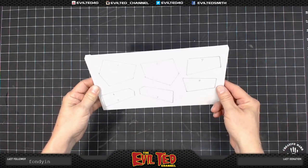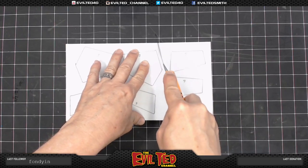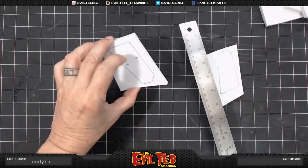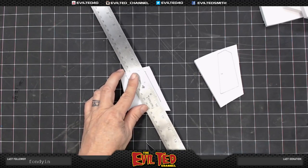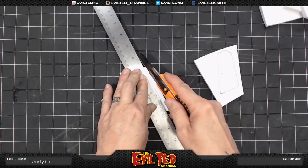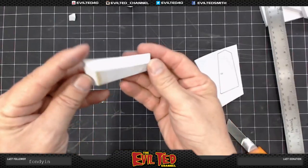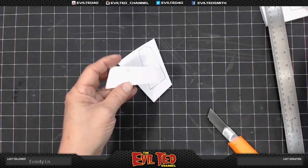Now this is the rest: the smallest part five, part six, and part seven. We're going to cut these pieces into bevels. I like to separate them — it's a lot easier to cut them in bevel. When I cut bevels, you have your part traced out. I always like to put the straight edge just over the line, because if you cut right on the edge I think you cut too much off. Put my blade at the angle like that. Nice, clean bevels — can't beat it. We're going to finish up six, five, and seven with this technique.